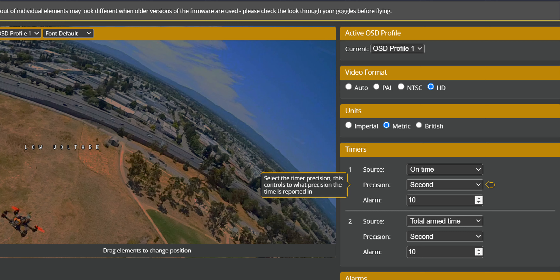Activation of this feature is extremely simple. Just go to the Betaflight Configurator, open the OSD tab, and select the HD format. The OSD preview will adjust and you'll be able to place elements how you want them. There is also a feature that auto-detects an HD-layout-capable VTX when you've configured the MSP DisplayPort and enables it when required. If you're using analog or the standard DJI OSD implementation, you're stuck with the standard format. For newer systems, just select HD and use all the space you have.